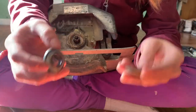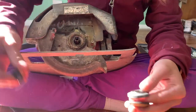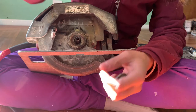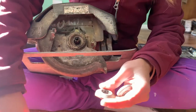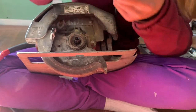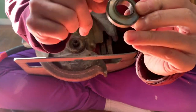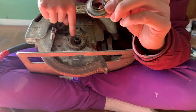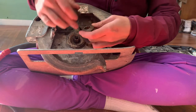The theory that I have is something is missing so that my blade is able to spin. I was messing around with it for quite a bit and thought, maybe if I add another washer to add some more height — remember, this is how it was. If I add another washer here, then the blade will be sandwiched between everything and be tight. But ultimately what I found out is that from use, this part of the washer itself has just worn so much that it's giving away way too much height.